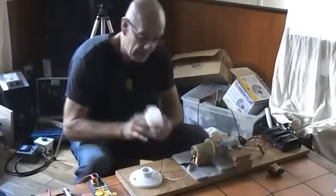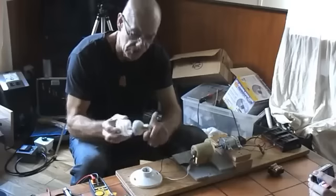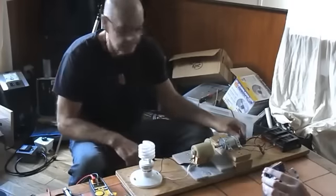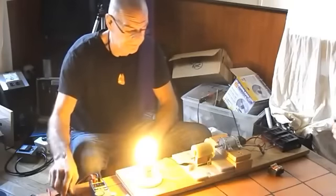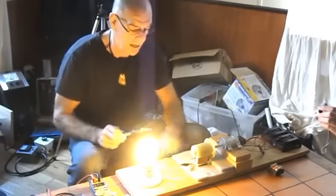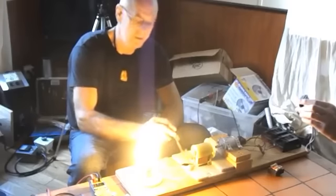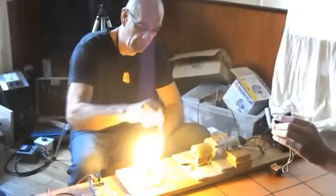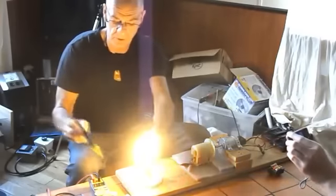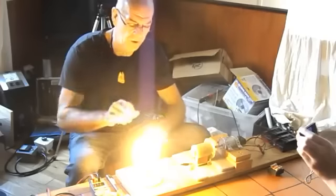We'll remove that and put this here. We'll use a twisty, which is a fluorescent bulb with an electronic ballast, which is a small computer. We'll put that on. And there you go. But something interesting happened. It's no longer AC. It became a DC square wave. This one won't pick it up. Alright? And it's fully lit. This thing only produced roughly 30 radiant watts. 30 watts only.